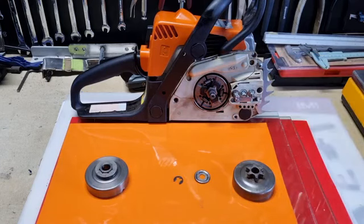I did a video on that on the larger saws. The only time I would advise going up to a larger rim sprocket size — most rim sprockets that come out are only 7-pin on saws around 60cc and up. It's only when you get to the MS-880 that it has an 8-pin floating sprocket. So on my MS-500i, it's a 7-pin floating rim sprocket, and the only time I would go to an 8 is if I was running a 20-inch bar, because an MS-500i can run a 30-inch bar, not a problem.